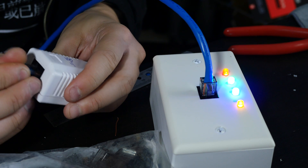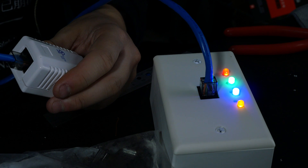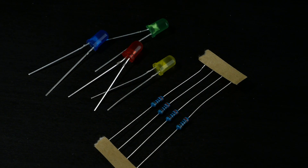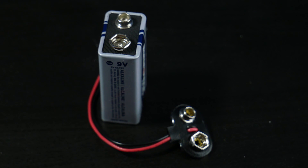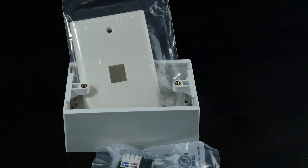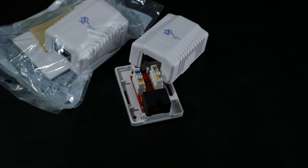This is a cable tester that I made. It is less intelligent than all of these — the material cost is about $10, so in reality it's probably better to just buy one. But I like to get into the nitty-gritty and build things. It looks really cool — I used a bunch of multi-colored LEDs. It runs on a 9-volt battery and operates inside of a surface mount single gang box with a faceplate, and a surface mount single port jack as the remote end.